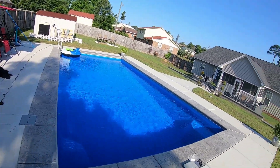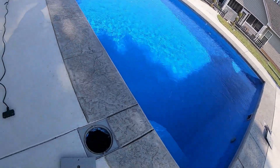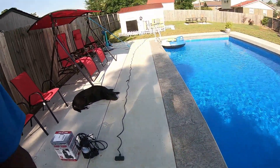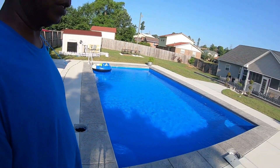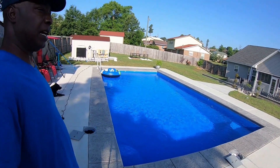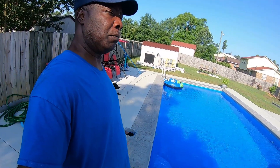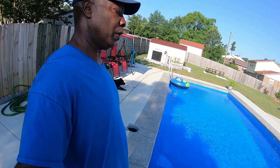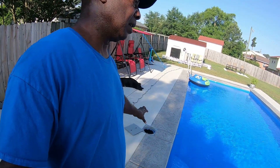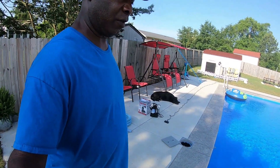The ground around the pool contains water from the ground — not water in the pool, but water around the pool in the ground. You have to manage that because if you backfilled your pool with sand, that sand is going to get wet, shift, and the pool is going to shift. But nowadays they're building these pools backfilled with rhino rock, and the pool is not going to move because that gravel is steady. But you're still going to have rainwater from the ground, so they built these drains to catch that rainwater.